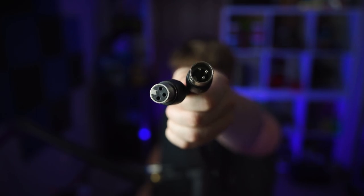But an XLR is just an audio cable. The reason it's called an XLR mic is because it uses a cable that looks like this — that is an XLR cable. You can see it's just three prongs. This is the male and the female end. The female end plugs into your microphone, and then the male end runs off into another piece of equipment. Now you may be noticing with a USB mic, you can just take that USB, plug it into your PC and you're done. But a PC doesn't have an XLR port, and that is where your interface comes in.